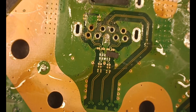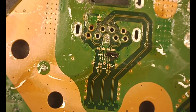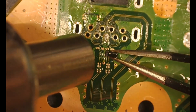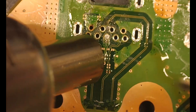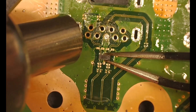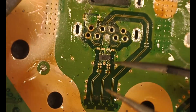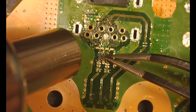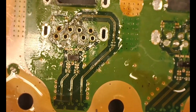There's this little rectangle — I'm putting some flux right down there to fix my mistake, because I actually heated up and bumped into this little filter for the USB. It makes it communicate properly. There are 10 little pads down there and it has to go right in the middle because those pads bridge through this little filter. You just got to put it right in the exact spot because on the bottom side there are connections. I put it down kind of where it's supposed to be, as close as you can, then heat it up again. You see, now it is where it needs to be. I wiggled it a little bit to make sure it was soldered everywhere — and we're back in business.